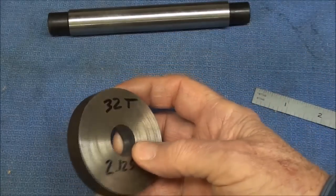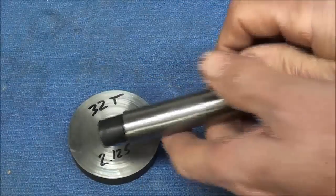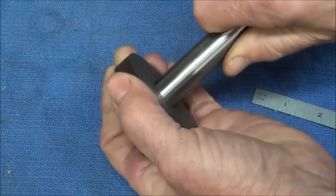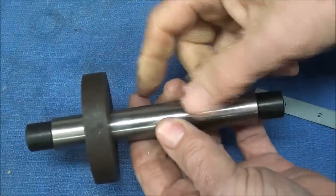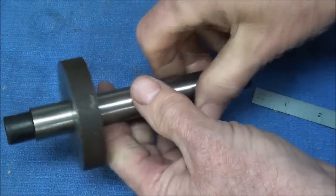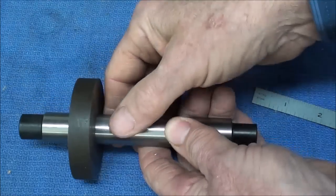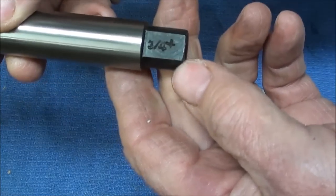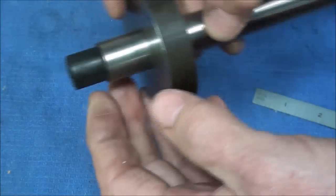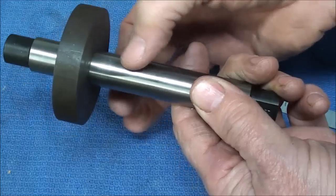I drilled this, then I bored it, and then I reamed it, so I got a real good fit for my brand new three-quarter-inch lathe mandrel, and that's going to be pressed in there. I've got it started — I'll press it in with a little oil. I'd like it to end up about in the middle of the mandrel. I explained what a mandrel was in the last video. I did have to buy a three-quarter one — that was $17 with postage. Notice it's got a flat spot at the three-quarter end; the marked end is the large end.